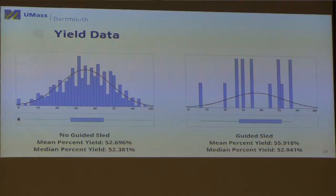This cost savings would be inaccurate if we produced more defective parts with our fixture, so we asked CPS Technologies for their yield data — how many acceptable parts per can. On the left, you'll see their yield data for the past year with a mean percent yield of around 53% and a median around the same. With our process, we tested 14 times at CPS's facilities and achieved a mean percent yield of around 56%, with a median around 53%. This tells us we are in the range of what CPS currently produces, so we're not making more defective parts, and the $60,000 cost savings is approximately accurate.